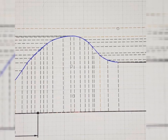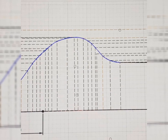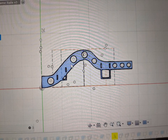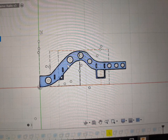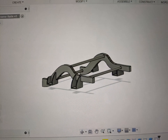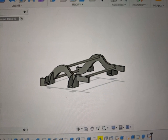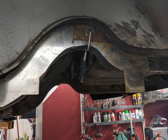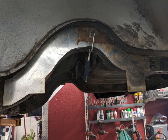I'm not the greatest at CAD, but I'm trying. Got all the measurements transferred over and made what I think the sub-frame might look like — I don't have the Model S sub-frame here yet, so this is kind of some guesses at what my gussets might look like. I know it's going to mount outside of my frame rails. I did cut out a trial piece on my CNC plasma cutter, took some adjustments, and made the changes in Fusion.